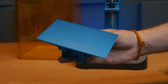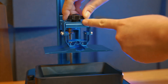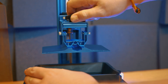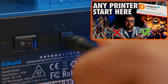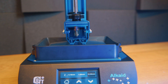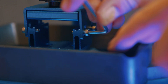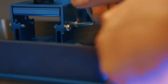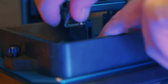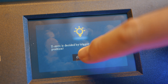The build plate is another sign of how cheap this printer is. There's no laser-etched or even sandblasted plate here — it's just the same blue painted aluminium face as the rest of the mechanical chassis. But in all honesty, so long as you get your base exposure layers right, which isn't that hard and I have a video showing you how to do it, there will be no issue with prints sticking to this or removing them. And now it even has a four-point screw mechanism found in higher-end printers, though in this case you can genuinely feel how soft the metals are when you tighten the screws, so don't throw too much force behind it and thread the screw. Leveling is easy — just loosen the screws, send the bed to home in the menu, hold the plate down as you tighten the screws, and back out of this menu to choose set Z to zero. Don't miss that last step; so many people do and then nothing will print.